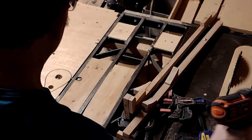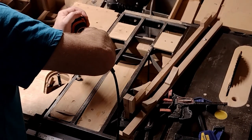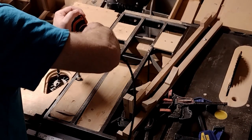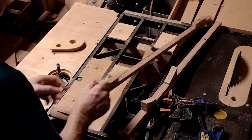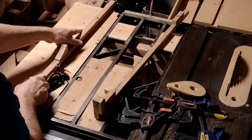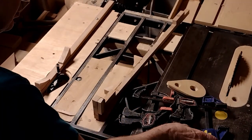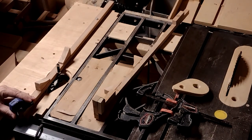Let's get back to the video and start watching the CNC cut this project. Before I can put the drum on the CNC to skim the inside, I need to clean up the top and bottom edges — or the left and right edges as it lays on its side. When it's carved on the outside we don't cut all the way through, because those clamshell pieces clamp onto it. If you cut all the way through it would fall off the CNC machine.